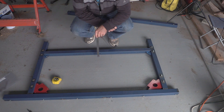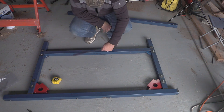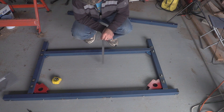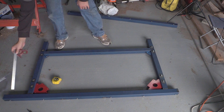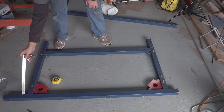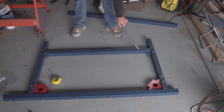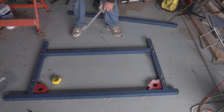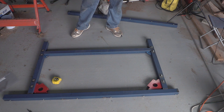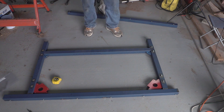This is the basic frame of the table — we've got our leg, our top rail, support beam, and our other leg. The plans call for an eleven and a half inch gap at this end, but I've actually had this piece of steel cut to 1200 mil instead of the recommended forty-four inches, which is like ten-fifty or something like that. So it's actually longer than normal.